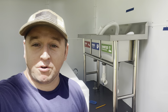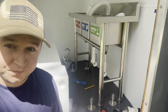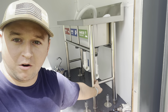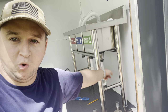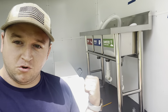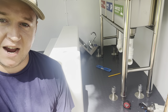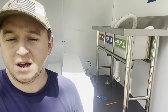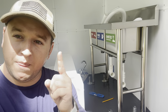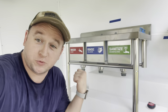One of the first things when going with this sink is that in order to get the undermount tanks underneath it, I need to remove this support bar that runs across the middle. We're going to cut it on one side, pull the legs out of the back, and that gives us enough space to get the two undermount tanks secured under the three-compartment sink. We already have the flange feet which give it extra elevation to fit nicely above the water tank.